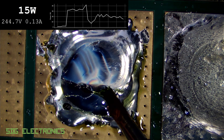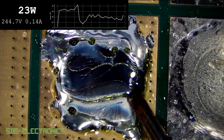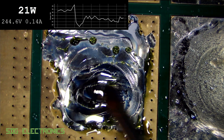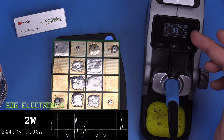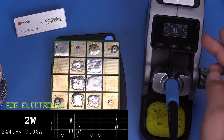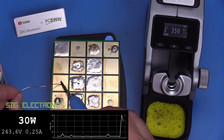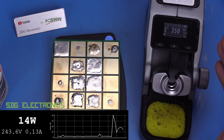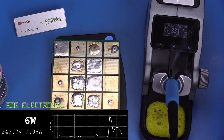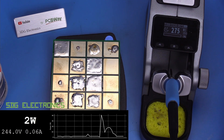With the battery pack attached, we seem to be drawing a combination of power from the external supply and the battery — peak draw from the external supply is around 20 to 30 watts, meaning you could use a lower power DC supply. One thing worth noting is they don't seem to have implemented a sleep temperature — when you put the handpiece in the cradle it turns the heater off entirely. A firmware improvement would be to allow a reduced temperature mode when connected to USB power, so it's quicker to resume soldering.